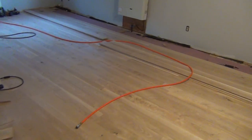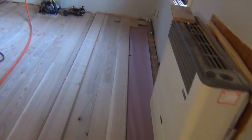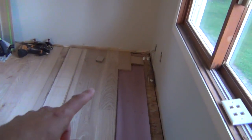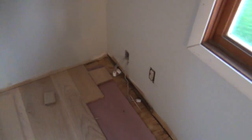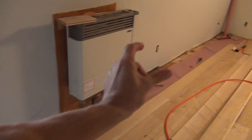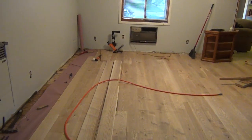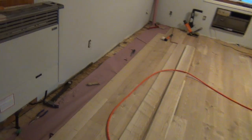The other big thing this week is I got really far on the flooring project — it's getting just about done. I made a lot of progress this week and I only have a little bit left. Probably gonna be another three rows: two full rows and then a partial one that I'll rip to fit. Overall, the distance on this side compared to that side is only off by an eighth of an inch, which means the two walls are probably pretty close to parallel — which is gonna be nice when I go to finish it.